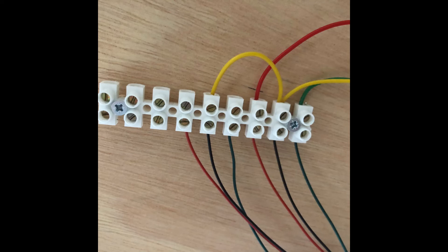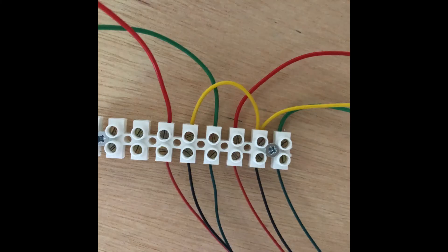In this picture we have the wires at the bottom from the second switch — as before: green, black, red going into the chock block — and then the corresponding red and green wires coming from the second switch into the chock block opposite their corresponding wires from the switch.